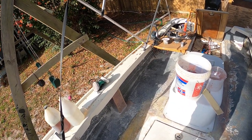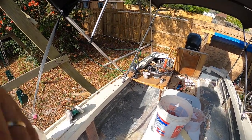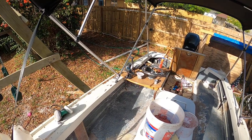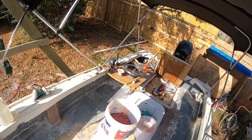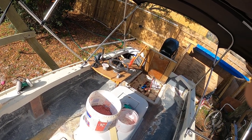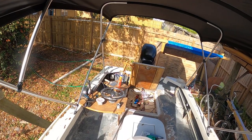Right now the rigging is a nightmare — I gotta go back through and wire it up nicely. This time it's functional, it works. I removed the marine amp from the speakers because it was giving me fits, so I tossed it. While I was under there I changed some things around to make it more reliable — marine connection fittings, the waterproof type you heat up, tinned wire, that sort of thing.